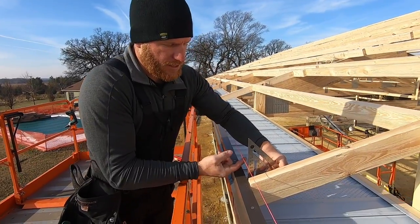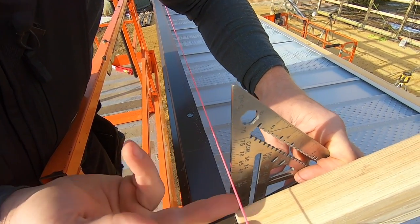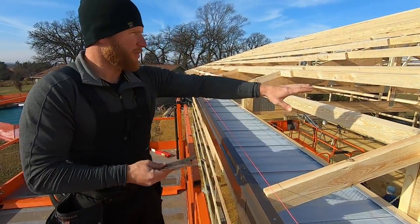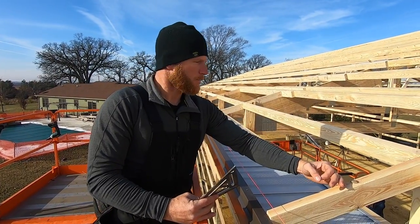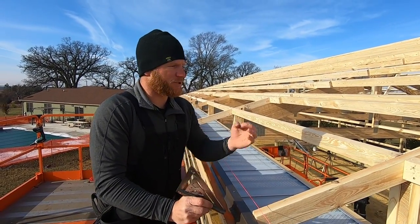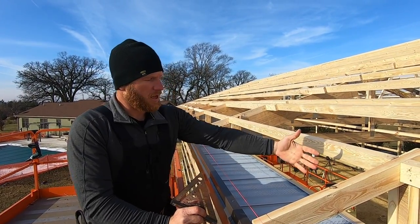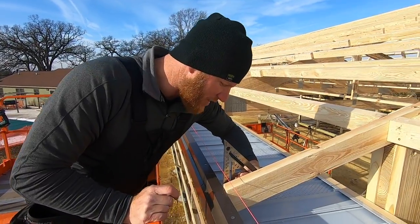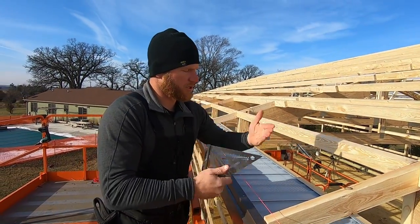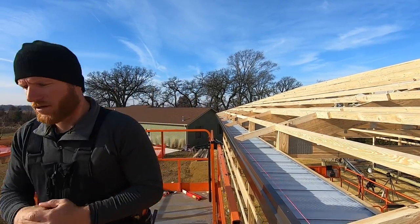I'm going to go back and double-check that nail because we set it there, put the string on it, made the big long trek down to this end — we want to make sure we've got the same thing on that end. You can see I've got about an eighth inch of a gap. What that means is I've got to bring that truss to the string line. There's nothing on this truss right now, but we need to put a chain at 14 feet tall. We've got a couple of different options — we can put a chain on the bottom chord, which gives us the ability just like our walls to pull the whole truss to this string line.